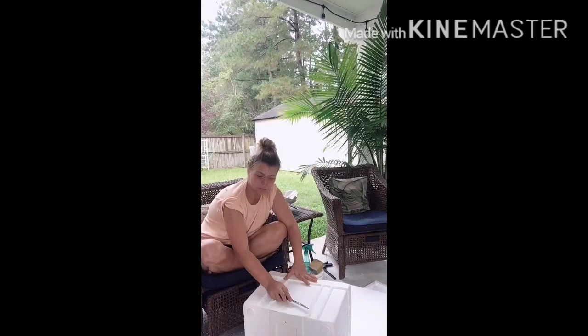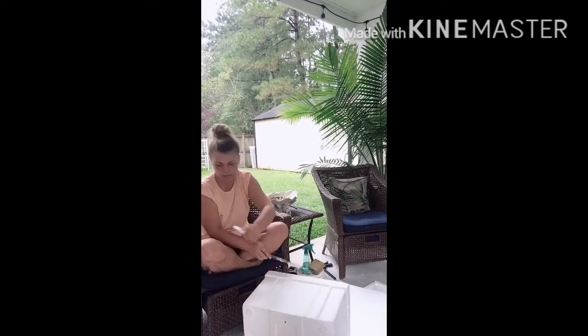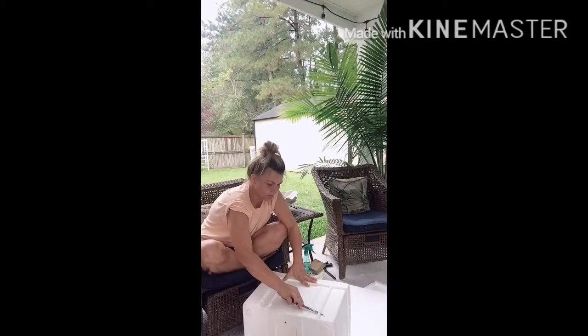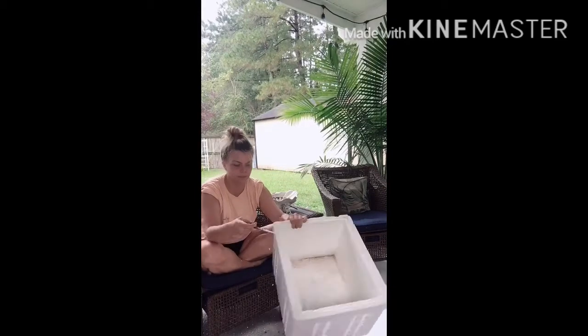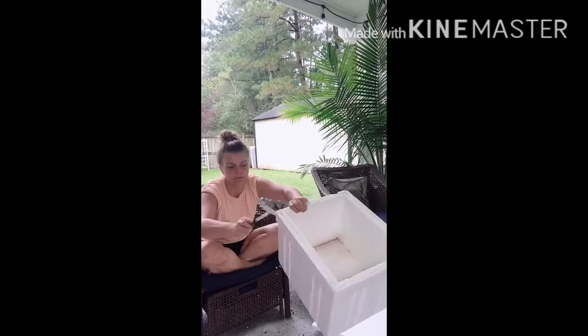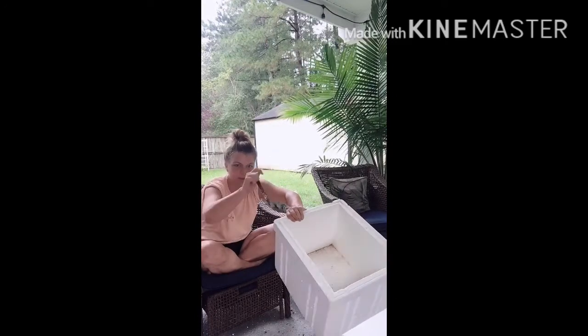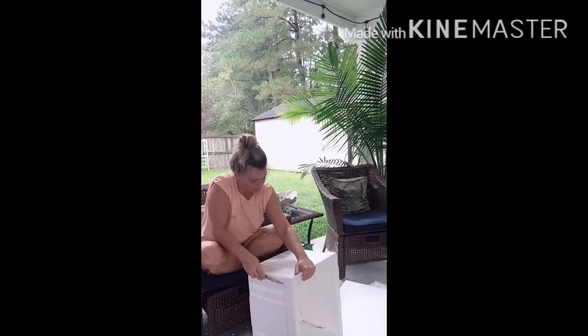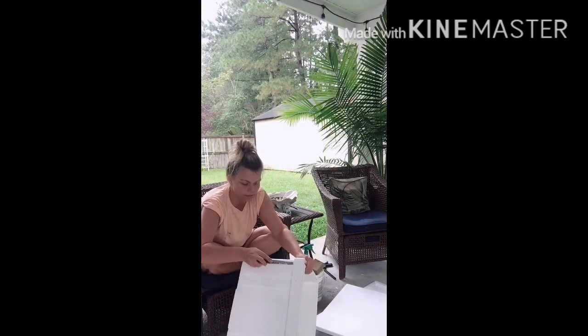Once I'm done with this, I'm going to sand it with 120, so don't worry about high points if you missed them or if they're a little too raised. Now for this — see how the lip here is stuck out? You can see it. But it also has an indention here. You've got to be careful when you cut this off that you leave just a little piece here, otherwise it's going to cave in. So I try to hold my knife and go as straight as possible, or you can come here and do it, but you might hit that. So I just come up here like this.